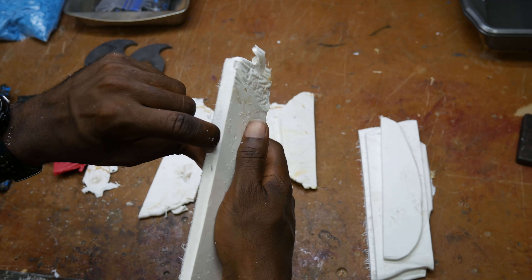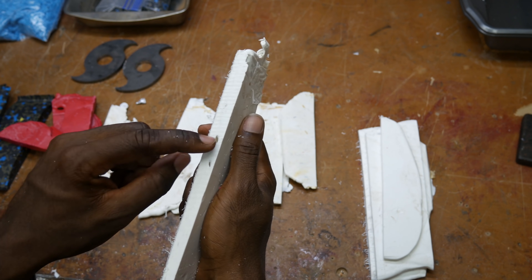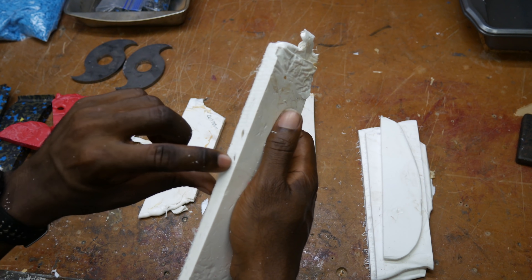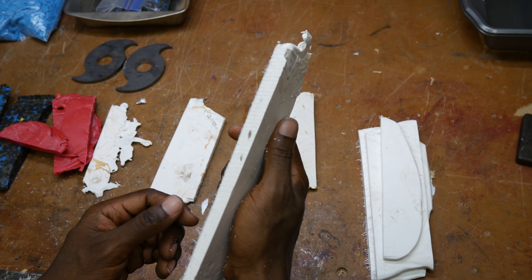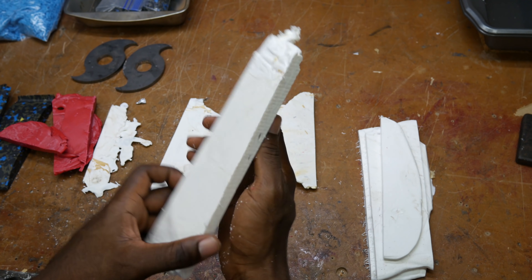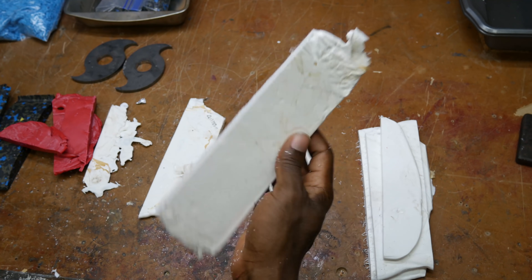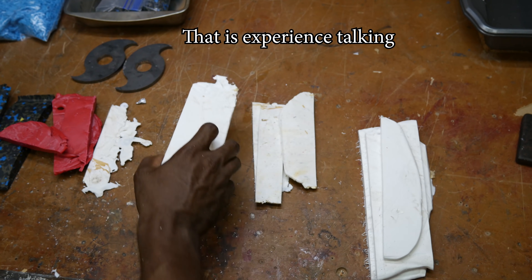Now that's the uncut edge — there's a big gap there. That to me is unacceptable. I can look down in that hole and there's definitely a cavity there, and there's another one right next to it. Even though it looks great on the outside, if you were going to put this on a lathe — of course you'd make a thicker block — but if your tool got caught in that hole you'd likely rip this thing right out of your chuck. So I'm not particularly happy to see that one.